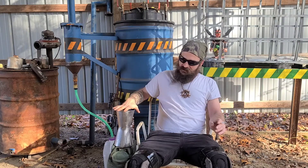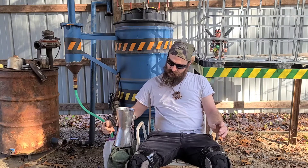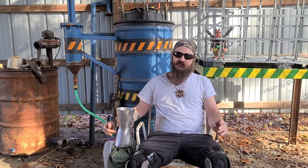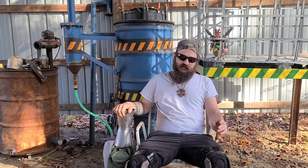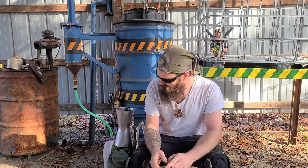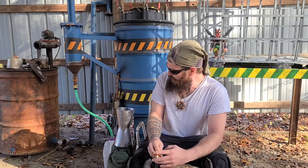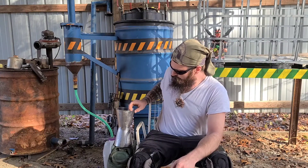When you go ahead and weld the inside, you can tidy that back up. All of this will get encased in a second layer like a pipe, and then we'll make a refractory cement with sand and plaster — Paris plaster, plaster repair stuff — and we'll pack it around it and it'll last almost forever. It's kind of like building a forge. But basically this will be the first thing you build.